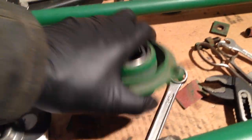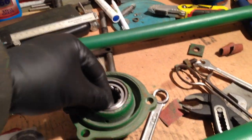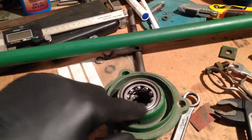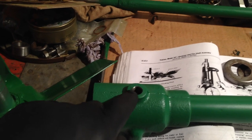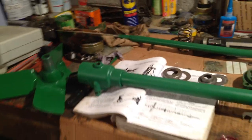And on the bench, underneath all the clutter, we put the new bearing into the housing that goes on the front of the governor. Already pre-oiled, because that bearing is oil lubricated from the engine, whereas the outer bearing, the one which goes in here, is lubricated by grease through this hole. So what I'm going to do is attempt to mount the camera if we can, and see what we can do.